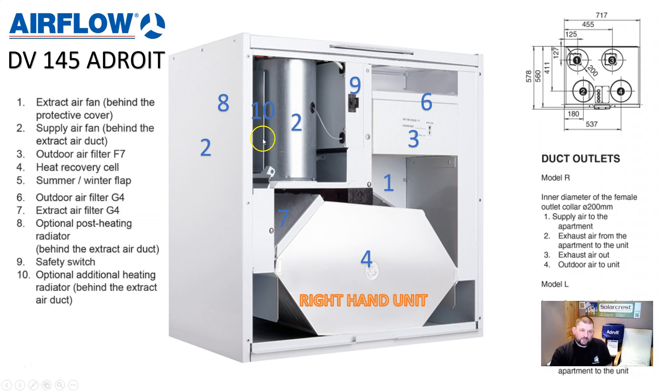There are optional post-heaters and pre-heaters in these machines. We don't always recommend them if you're on the south coast or in London where there's not much frost these days, but if you're in a colder climate then we may recommend the post or pre-heater. Underneath there is a condensate track — this unit comes with a little vessel which you connect on the underside, with a connection that enables you to get to 21.5mm standard overflow pipe, which we run to the nearest drain.